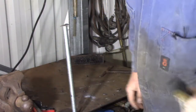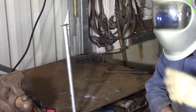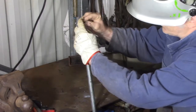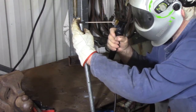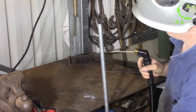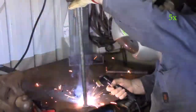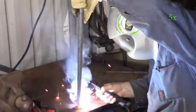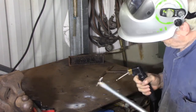Getting the initial tack on — this is going to be the trickiest part. I can't tip it upside down or all the sand will fall out, unless I manage to hold the piece of metal perfectly in place. So I'm going to try and hold it there and just get a tack on it. She's tacked. I can now turn it up and put the other tacks on. There we go. Still got room for any pressure to escape. That should be good.